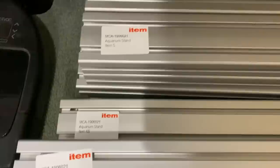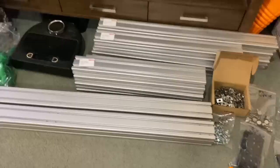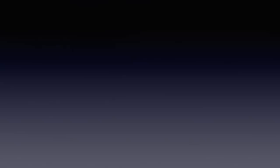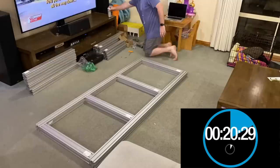We even got things like 6A and 6B and 5, and then of course a whole box of fasteners and end caps. These are the bits that quickly add up on the price, but being stainless I just wanted it not to rust — so it was well worthwhile. The team at MCA also gave me a suggested assembly list — they broke down what number each part was, and then recommended which parts to assemble first. They recommended building the top frame, then putting on the eight vertical posts, then fitting in the cross bars, putting on the bottom parts, and flipping it over once you've got the feet on.